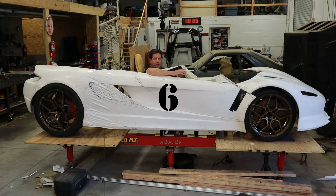So what are the problems? In a nutshell, I just don't have enough legroom. I built this frame based on dimensions of a Lamborghini Aventador — 106.7 wheelbase; this is a 106.5 wheelbase. I thought for sure I'd have enough space inside the cabin, given the fact that they actually have a longer and larger engine. I was wrong. My suspension mount points — I'm using the Corvette subcradles — are just not cooperating, especially in the front.